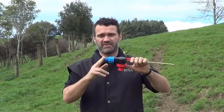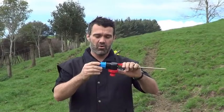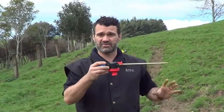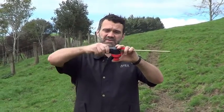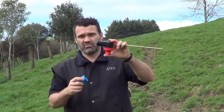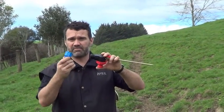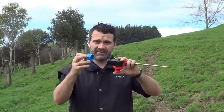Another aspect is that when you get on the farm you've sometimes got the wrong size — you've got a 25 mil when it's a 20 mil trough, or a 20 mil when it's meant to be a 25. The one we've installed today was a 25. This blue bush here, which is bushed down to 20 mil, we simply remove, and you've got the 25 mil there to be installed. The 20 mil has an o-ring inside it which seals on that face, so there's no requirement for thread tape between the two bushes, and it's extra strong so it will take the installation.